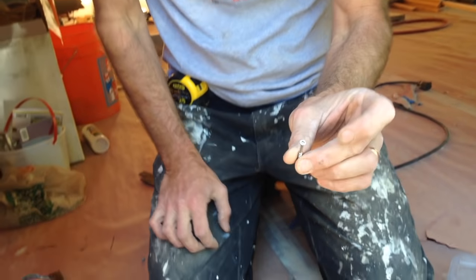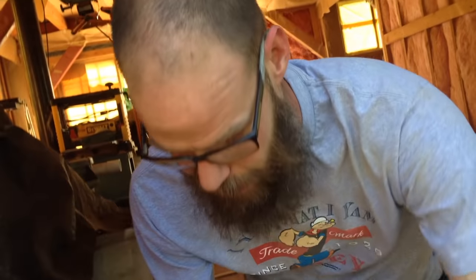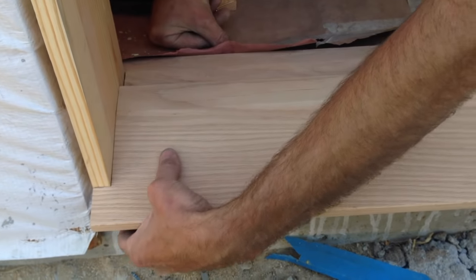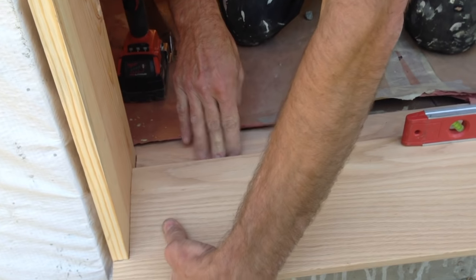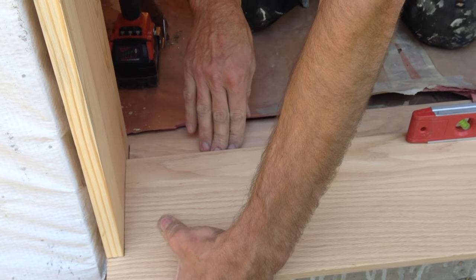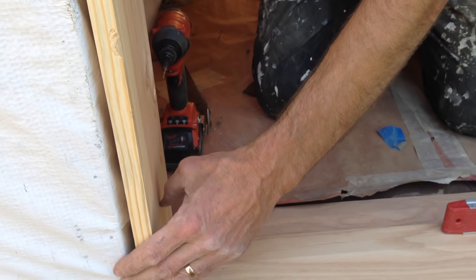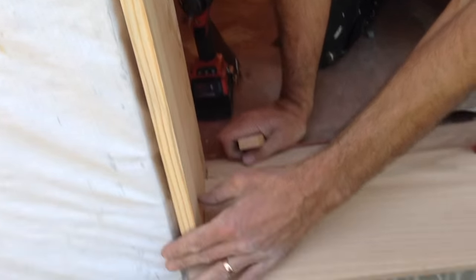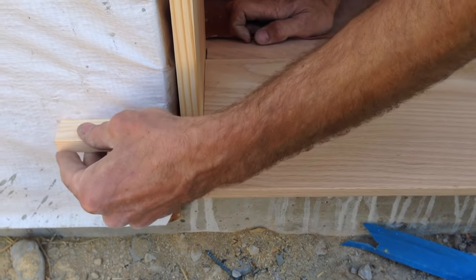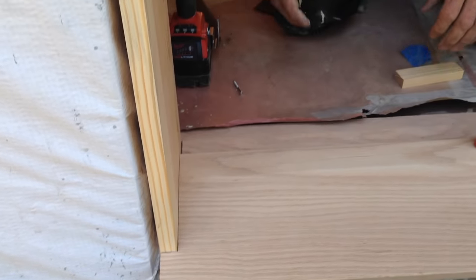Using these stainless trim head screws, I'm just going to see them, but I'm going to put them in a pretty inconspicuous place, which is right under the door. So you won't really notice that. I'm going to start over at this side, because this is the side that's actually contacting that piece of wood without a shim. That's my low point, so I'm going to go ahead and suck that down, checking that I'm good on my drywall thickness there. Looking pretty good there. Just proud of the surface.